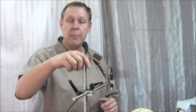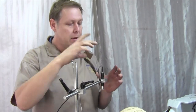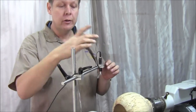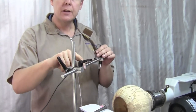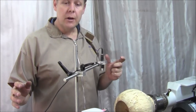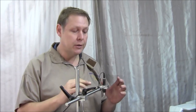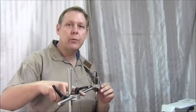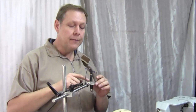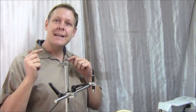I've set the laser system up — the main stem is already in the hollowing rig, we've got the boom arm, the head which is screwed on, and a couple of cable ties to keep the cable out of the way, all plugged in. When setting it up, just make sure it is parallel — I just eye down and make sure it's parallel with the reference point. If it's at an angle it will give you a false reading.